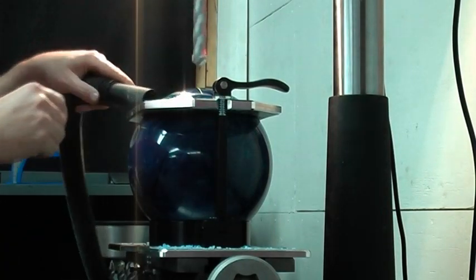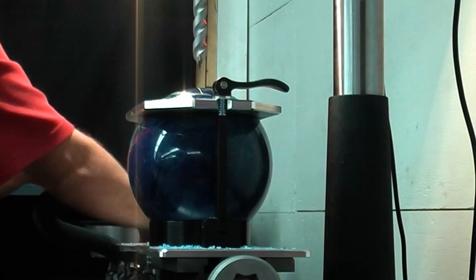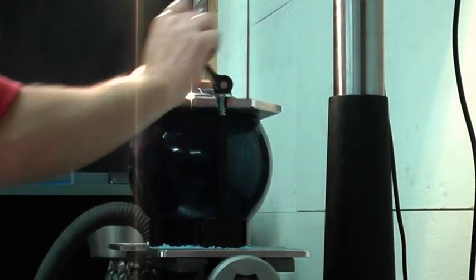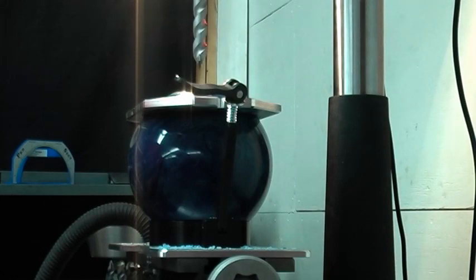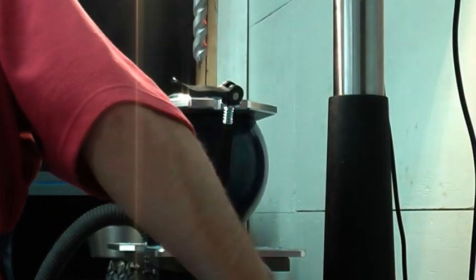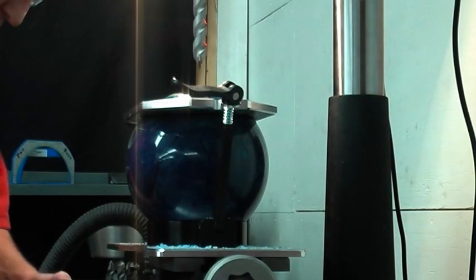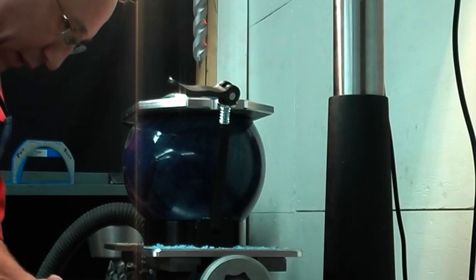I'm going to stop right there. Turn off my drill press. Now I'm going to loosen up the ball and dial in a half right and 3/16 reverse. Looking at the front here, we crank it to 1/2 inch right, which is right there. Then 3/16 reverse.